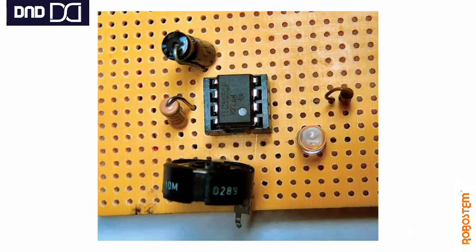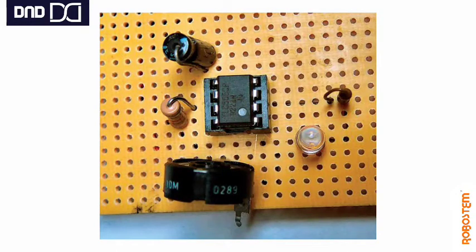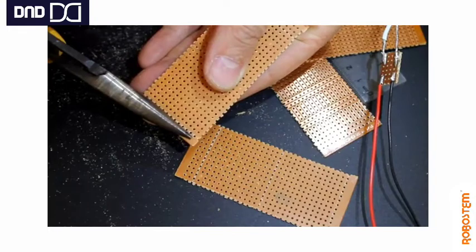Sometimes you may not need the entire circuit board. PCB boards come in different sizes as you can see in the picture. You may only need a small part, so you can cut the PCB. Just mark the number of holes and grids you want, and mark the area with a scale. Use any sharp object like a screwdriver or a cutter to make a scratch, then break it with a plier — holding the plier near to the scratch mark.